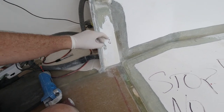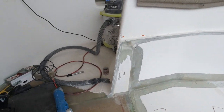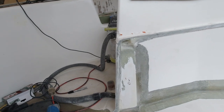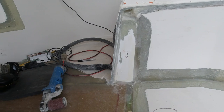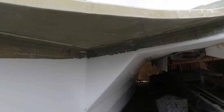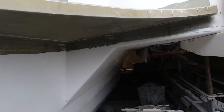I'll be able to tab around the corner here, glass all this together and make it all look like one piece - that's the plan. I've got this mold here that is going to form a join mold around the back of the stern where the hull and the deck meet. For now I'm just going to grind this away, get it all sanded up and tied up ready for integration like all the others. I've already laminated underneath today - that's actually got four layers of 600 double bias holding that together with varying overlapping tabs.